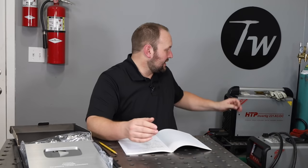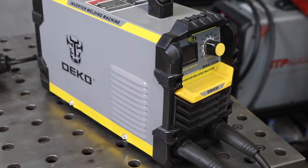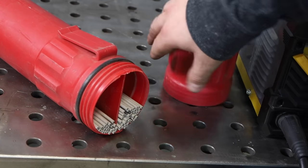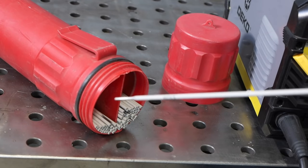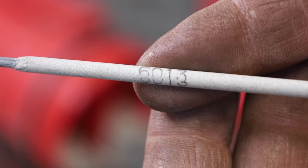Now that this thing is bent into the shape I want, I need to weld up these corners. I would much prefer MIG or TIG welding for this job — that's what I'd use on a daily basis with nice machines like this InverTIG 221 and the Pro Pulse — but I'm going to do it with this Deco Pro stick welder, just over a hundred dollars on Amazon, so you can see that you can do this with about anything. As far as electrodes go, I'm using a 6013 electrode. I don't usually care much for 6013s, but for welding an outside corner joint on sheet metal they can be just the ticket. A 3/32 inch size — 2.4 millimeters — is going to work pretty well, but 1/16 inch or 1.6 millimeter electrodes would make it even a little bit easier.